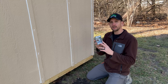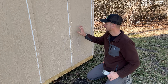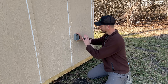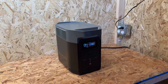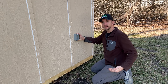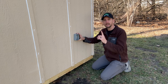So let's go ahead and jump into it. We're going to start off with this exterior-rated box and mount that to the outside of our shed. I just have T111 siding here so I'm going to make some blocking on the back so I can get a more secure mount. Now with this box, this is really where the feed would come in. For me I'm going to power this from a portable power station, but if you're bringing that 120-volt 20-amp through conduit buried 24 inches in the ground, I'll give you a link in the description to a similar project.